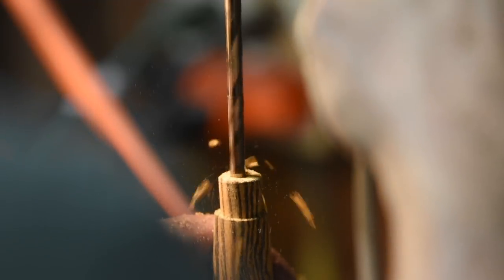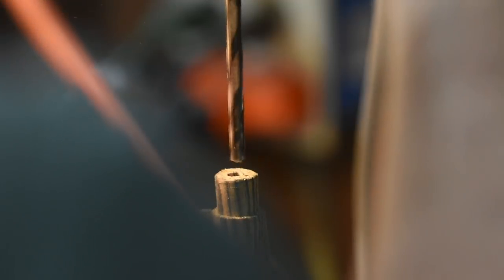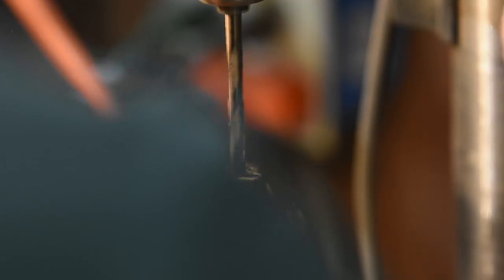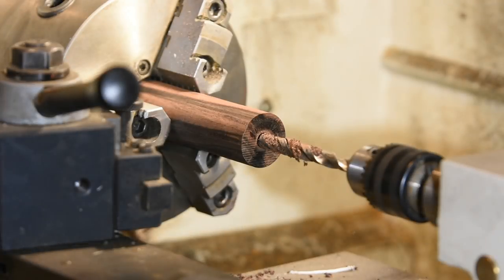Next, I drilled a hole appropriate to whatever tool I intended to install on the handle. Since I did several of them, the holes are different sizes. Incidentally, there's a good argument for chucking up the blank when you first turn it down from the square, drilling the hole out of the tailstock, and then reinstalling it on the spur and turning it to final dimension. But it's a little bit of a pain in the neck to go back and forth, so I just drilled the holes at the end. The problem with that, of course, is that it's a lot harder to drill them perfectly concentrically.